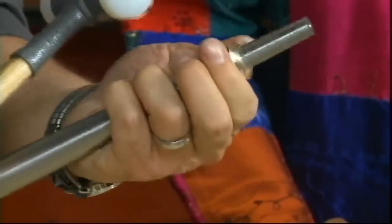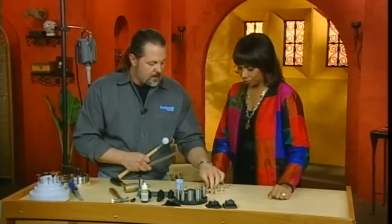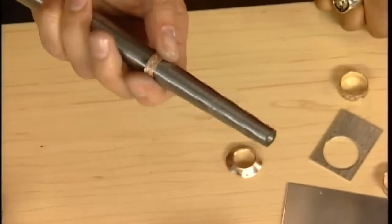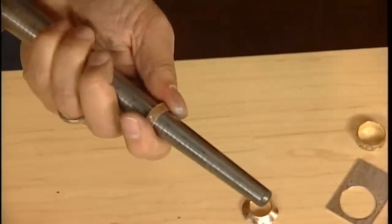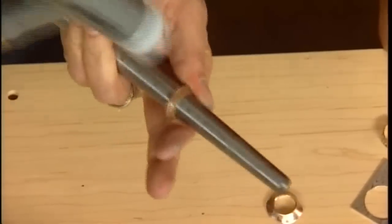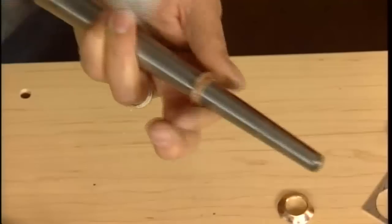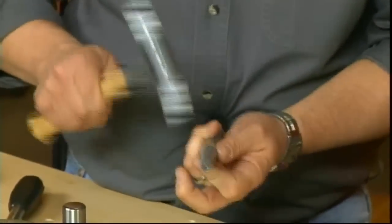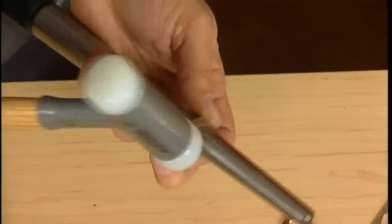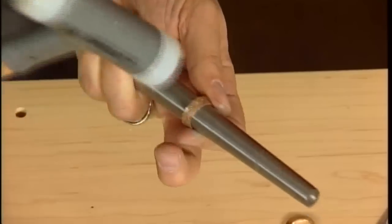Look at that. We're getting there. Eventually it has a little dome already. Now see, this has been annealed. You can see the color change. I've actually taken it down to about 6 3/4. Annealing is when you put the torch to it to a dull red and then quench. You can see it moves so much easier when it's annealed. We'll take it just a little bit further, probably to about size 8. What I have noticed is that the 1/2-inch center and the 1 inch outside diameter yielded about a 9.5 size.